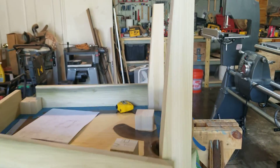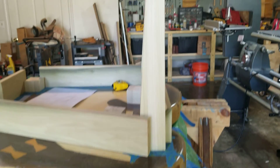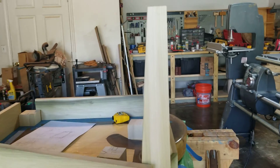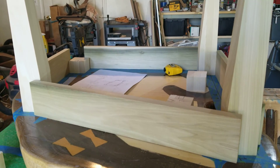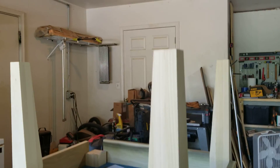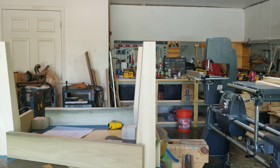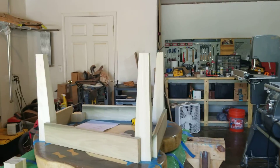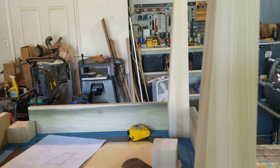I've actually got a small taper on the inside corners of the legs. The reason I did that is the top is so heavy I've been really worried about it being tippy. I don't want the leg to kick in and minimize the diameter, so I'm doing straight 90 degrees on the outside of the leg but a taper on the inside on two sides. That gives a little optical illusion that makes the legs look like they're kicking out a bit, which is kind of nice.